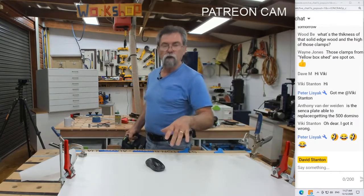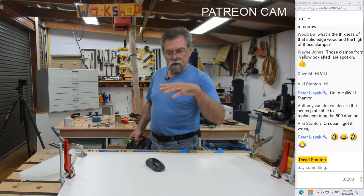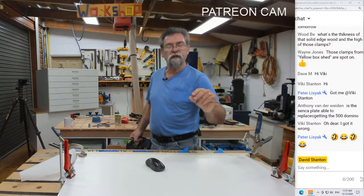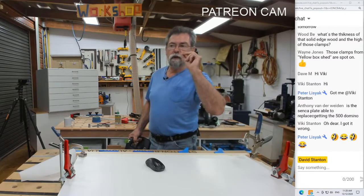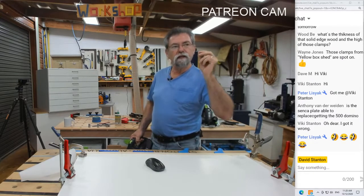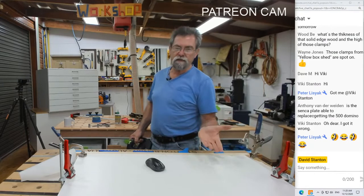So I normally try and center a domino, like the actual dowel. I try and center it in a board. So this being 16, the ideal position is 8 millimeters. Going down 10, I'm running the risk if I was to use a 6 millimeter domino itself, I would only have, you work it out, half of 6 is 3, and 10 is 13 millimeters to the edge on one side. So I'd only have around 3 millimeters. I'm starting to get a bit thin there.